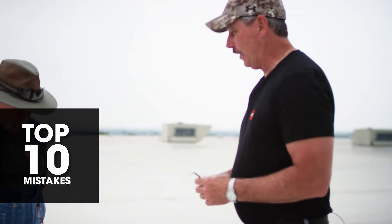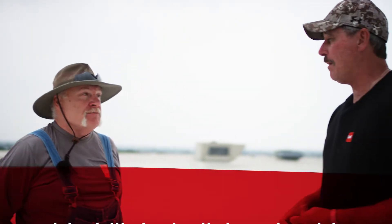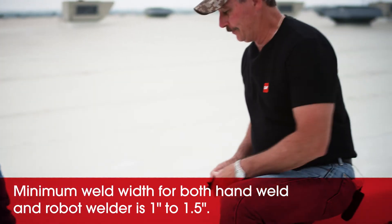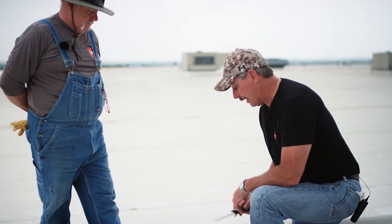What are we talking about today? We're talking about welding. What's our minimum hand weld? Any hand weld, even the robot — what's our minimum? We're looking for a minimum of an inch to an inch and a half per spec. As you can see here, does it look like we've got an inch and a half? No. We'd have to include the wrinkle, but that's another issue.